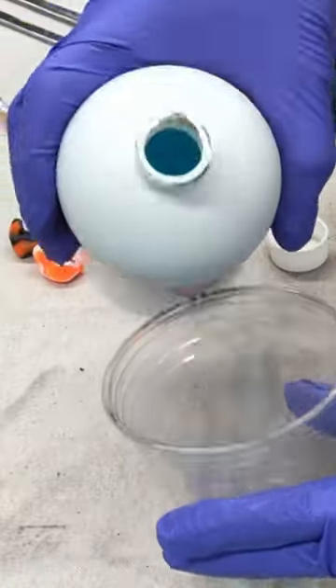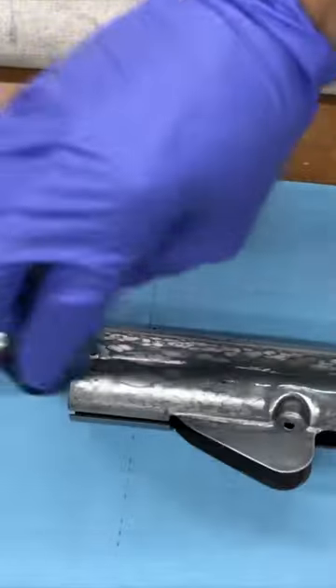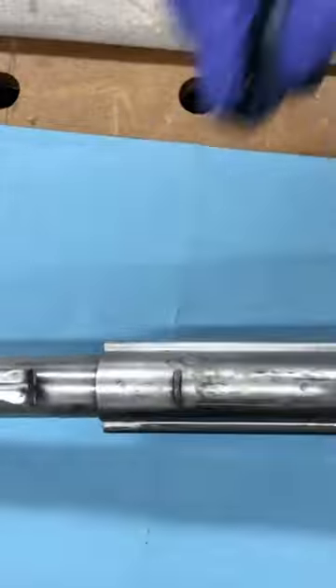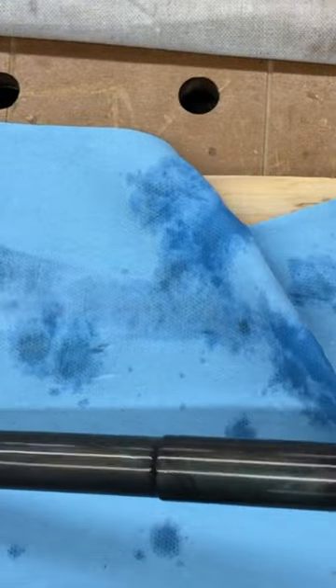When I was a kid I did a horrible job restoring this piece and did an equally horrible job spray painting it. So to make it a little bit better, I stripped that paint off and used a bluing solution — I'd never used before. I watched some YouTube videos on it, it looked really easy, and if you follow the steps it actually is. You can see that it oxidizes just that fast and leaves this really cool bluish-black look.